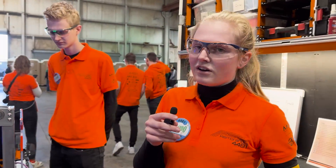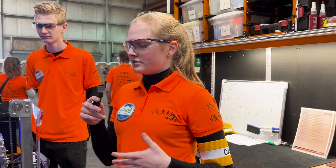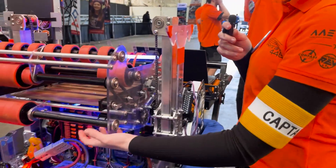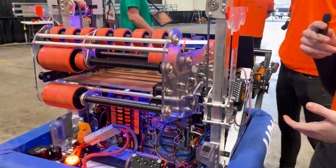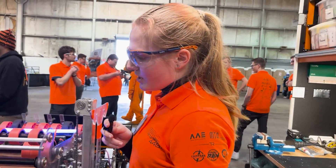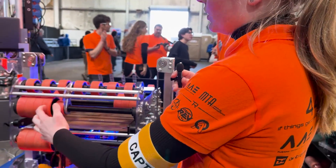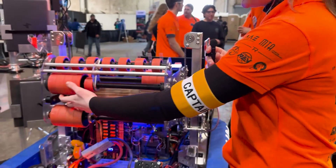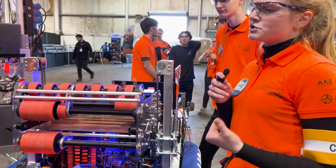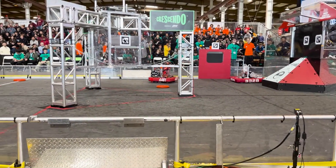It took quite a long time before the notes arrived, so we had time to make proper prototypes in the first days of build season. We laser-cut some wood side plates for our shooter, and we immediately built a system that looked like this but with a lot more axles. We saw that it really worked. The amp system worked well, but our shooter had some issues because we weren't sure where to put the rollers and wheels. We finally ended up with wheels on only one side of the shooter, because this adds spin to the note so it guides through the air better. This makes us shoot more accurately, though it loses some thrust so we can't shoot as far from the speaker — but we can still shoot really accurately.